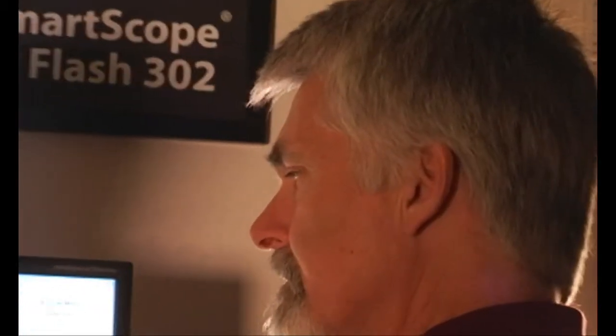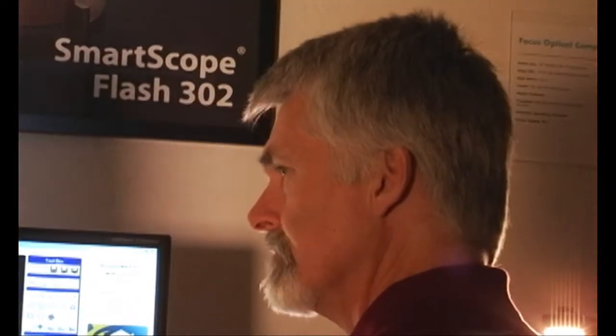When you're doing something optically, you have to get energy transmitted and energy received. As long as the geometry of the surface lets us do that. You can imagine that if the laser light is being transmitted at a certain angle and being received over here, if we were going down into a hole, as soon as that laser light gets blocked, suddenly we can't get light down into the hole and back out. We're trying to match the customer's needs with a solution that meets a lot of criteria, both technical and commercial. Okay. And environmental. Hey, well, thanks. Well, so this has been the SmartScope Quest with both vision and touch probes.